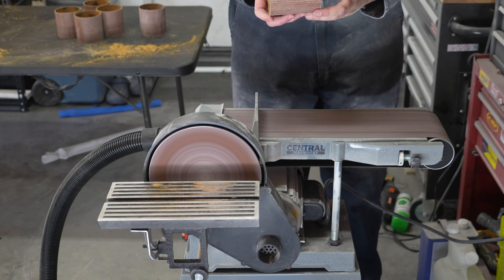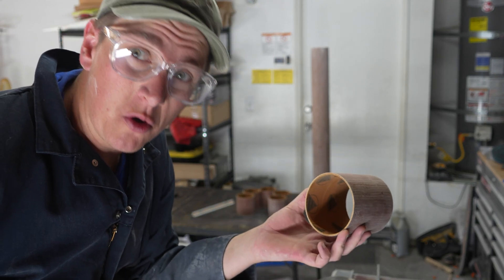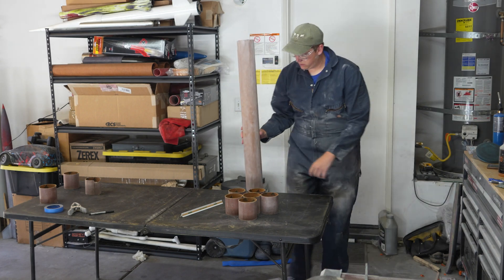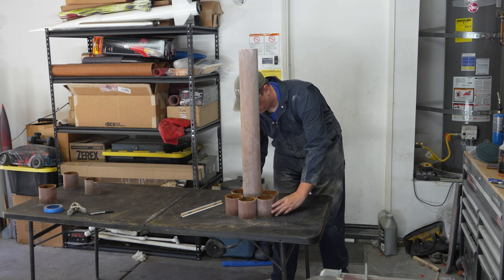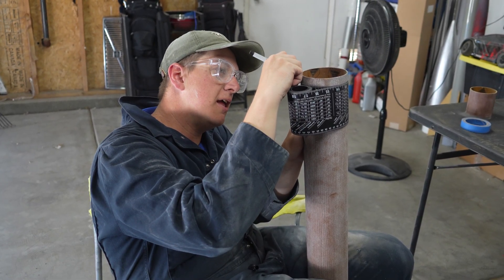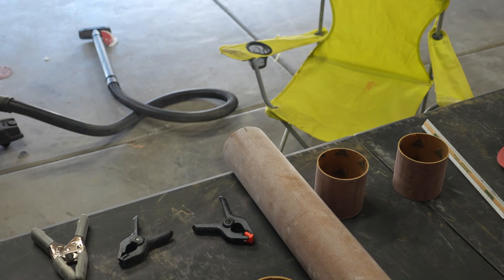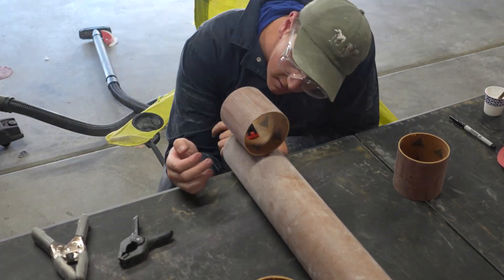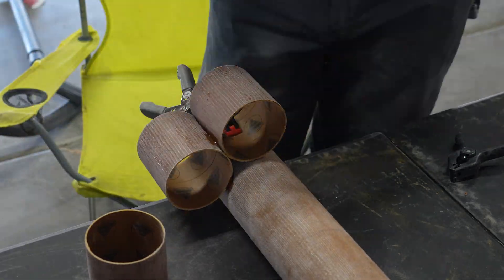It was at this point I realized that I made a mistake — it turns out this was a coupler tube, so they don't quite reach all the way around. In most cases, a tube fin rocket is great because using six fins nets you a perfect circle of tube fins all touching each other around the circumference of your main airframe tube. Since my coupler tube is smaller in diameter than my airframe tube, I used this handy pipe wrap measurement tool that Great Western Buildings sent me to mark the tube at 0 and 180 degrees. The plan became to center one tube fin on each side and glue three of them to the airframe and to each other on either side of the tube. I made sure the bonding surfaces were clean and proceeded to glue all the fins on with a simple 5-minute hobby epoxy and a handful of clamps. And if you ever see this rocket in person, please don't look at the gaps between the two sets of tube fins — they're not the same on both sides. I tried. I know. I'm sorry.